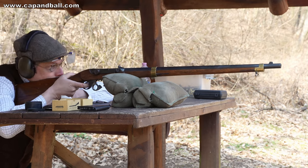But if you see one Kammerlader with the crack, don't worry about it because it won't cause any problem. It can easily be repaired. Another good feature of this rifle is that field stripping is very easy because you can disassemble the gun without using any tools. Let me show you how to do it. First, you have to remove the barrel bands. They are held in place by springs, so it's quite easy.